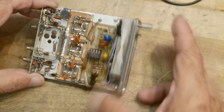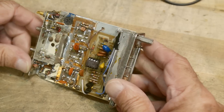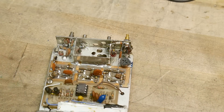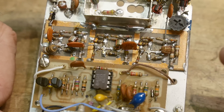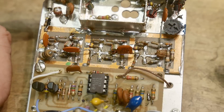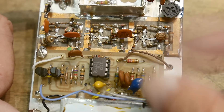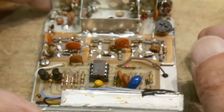We know this is an amplifier, and we know the upstream unit is good and the downstream is bad, so there must be something wrong with this thing. There's a little PC board — it actually looks like a Teflon board — with amplifier, amplifier, amplifier stages. And then this little board over here is a leveling circuit: it monitors how much power is going in and coming out and adjusts it.